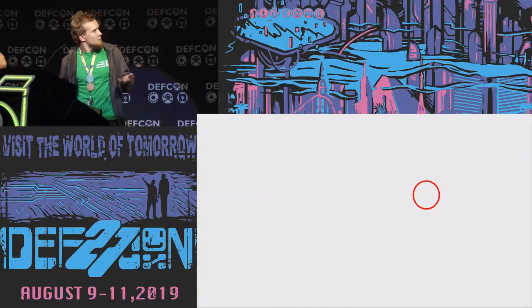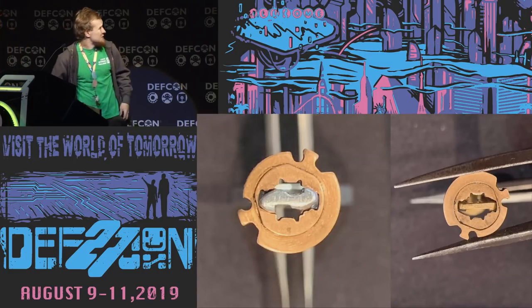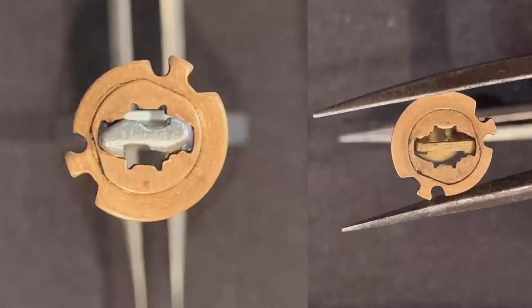so you'd wonder how do we throw it? Oh, okay, so we have a little bit of a snowstorm here. All right, so let's use this one then. So what you can see here basically is this disk is the tip warding disk. It's at the end of the lock, and when the key goes in, you can see on the top left of that, there's a little bit of an indent going into the key, and that's their tip warding, and both of these keys here were handmade by us.